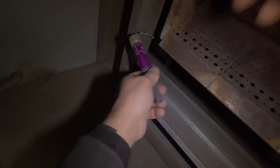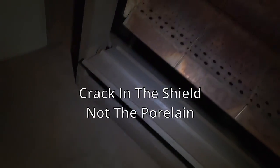So here's the pilot. We're going to go ahead and put this back. I think what we had going on is our dampers are in the wrong spot — that's our issue. Don't want to get too tight on that. I've cleaned the pilot out, I've done everything under the sun. I've adjusted the electrodes. There's a little bit of a crack here on that, but cleaned all the main burners out. Did a little bit of everything. That's the fight that I've got going on right now.